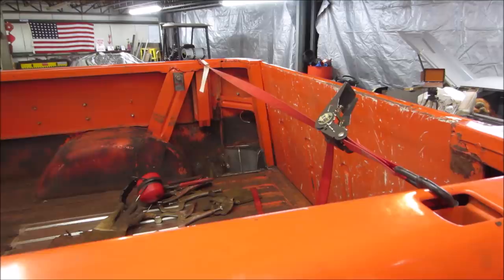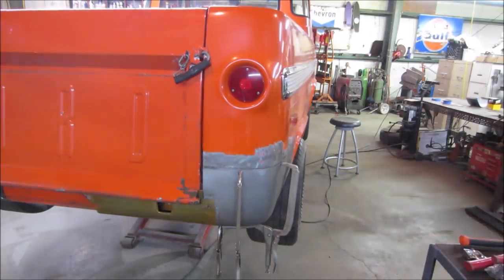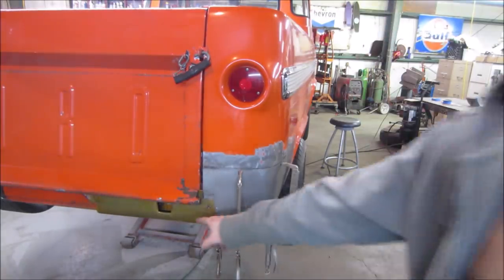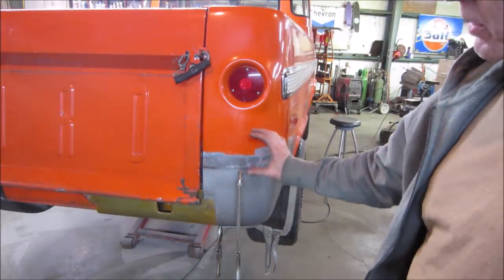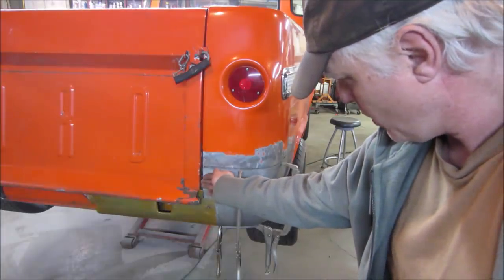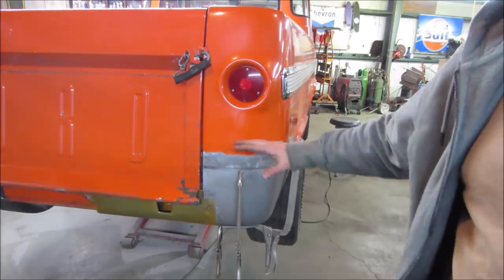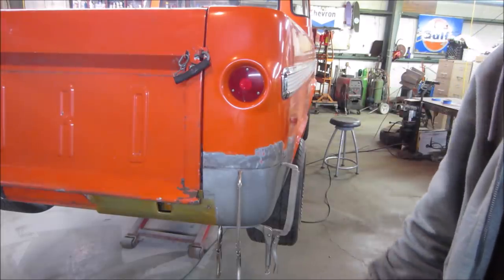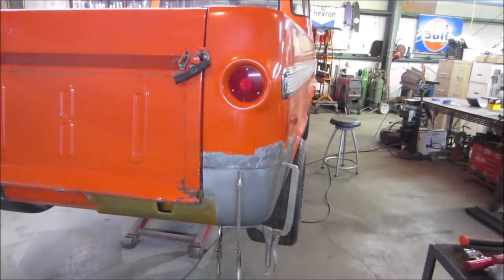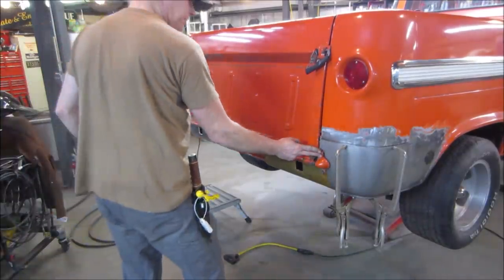The reason why I did it now is because that corner is not welded. I'll show you. Yeah, although the sheet metal going down the wall is kind of supporting it a little bit, the bottom corner between here and here, this triangle, is all still free. All this stuff can still kind of move a little bit. It actually looks like the gap might even have opened up a little bit there. But that's why I did it. So before that's welded and tacked, and before that floor section is made, now it's more in the correct position. So the rest of the stuff I make and start tacking, I want to hold it there, or hopefully hold it there. Still missing a bolt down here, but